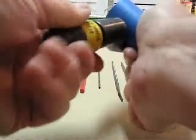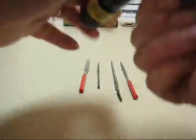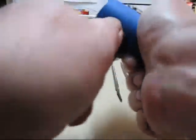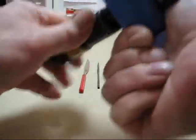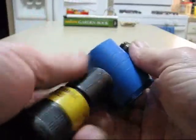There's not much to grip onto. It would be a lot better to do this in a vise, but I'm inside instead of outside. You don't want to cut too awful deep, because these tubing cutters can cut the whole aluminum tube — cut it right in two. I just want to make a starter line so that when I use files, I can open that up.